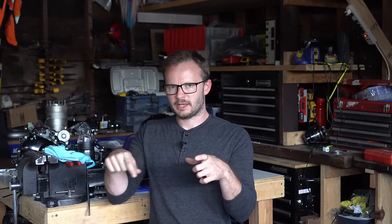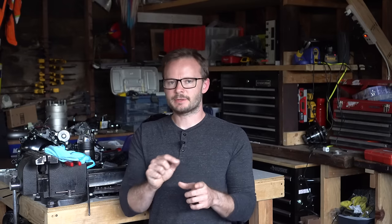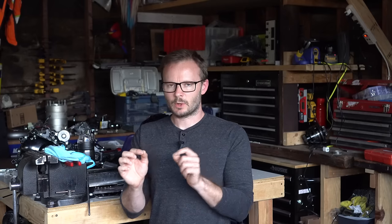So, funny story: when I first tried to shorten the pan I cut the bottom off, traced it onto an aluminum plate, and tried to weld it on — but it kept cracking. Then I remembered that motorcycle manufacturers sometimes make oil pans out of magnesium. So you just watched a whole video of advice from a guy who tried to weld aluminum to a magnesium oil pan. I ended up buying a magnesium plate, cutting it to size, cutting thin strips for filler, and TIG welding it together. We did it at work with some fabrication guys — none of us had ever welded magnesium before — with a Class D fire extinguisher right there just in case. Nothing caught on fire.